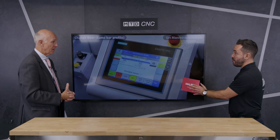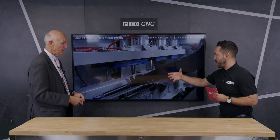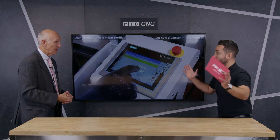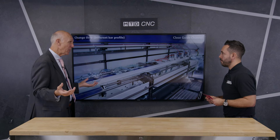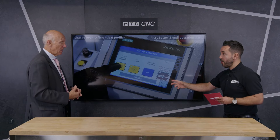Let's move on to the build of the bar feeder, because this is very important. If you're loading 100mm diameter bar at three metre length, it's going to be heavy. It's massively heavy. The whole HD range from IEMCA — which started with the Boss — means the main beam of your bar feeder and the rigidity of the legs are the two main features giving you the rigidity needed for that kind of bar. You can't imagine the weight and forces behind a 100mm, three-metre-length bar running at speed.